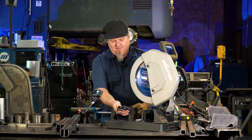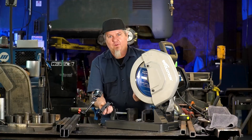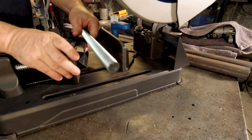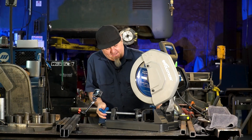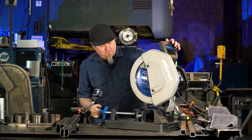This is a little angle block that they've thrown in, and what it does — if you have round stock or square stock — you kind of put it right in here, just slide it on the end there, put it up to your piece, lock it down. Now it's actually touching on three different sides and holds it in there nice and solid. Works real good.